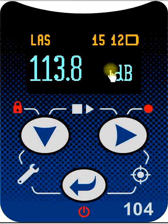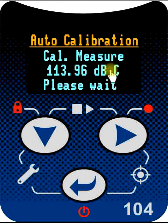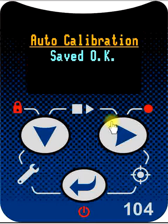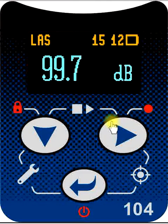When the signal stabilises you'll see the typical 114 dB or thereabouts signal indicated. After a few seconds the instrument goes into the auto calibration routine — it makes the measurement, asks us to wait, and at the end gives us the calibration factor it has introduced to bring the instrument into correct calibration. We can press the down button to cancel if we don't wish to save it, or more normally press the right arrow button to accept. Calibration is accepted and saved prior to the measurement beginning. Turn off the calibrator, remove it from the microphone, and we are ready to start.